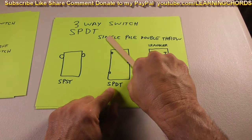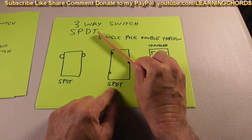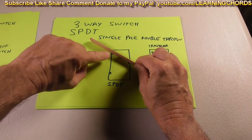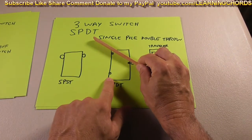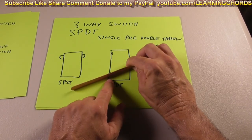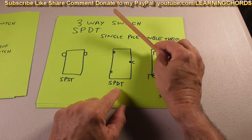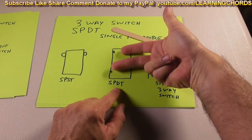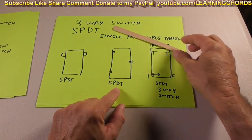So you could have the switch over here, the single pole double throw. If it's connected this way, we connect this common to this screw, to this circuit. If we flip it, we connect it this way. They also make a double pole double throw, which I didn't include, which would be two of these. So you could have two switches, two wires, two commons that go this way or that way, but I didn't put that on here.